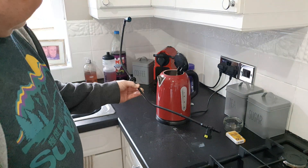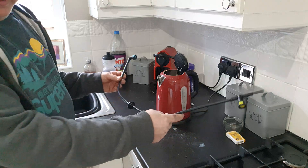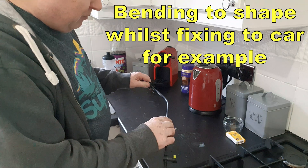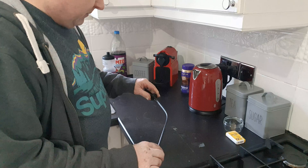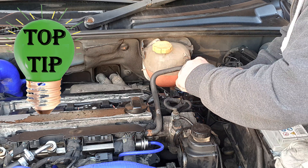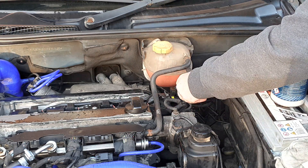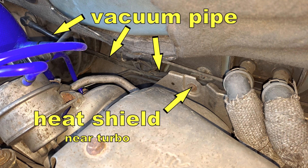I'm not actually going to attempt to replicate the pipe I'm replacing exactly — putting these two pipes in means I can give it a slightly different route around the engine. You could use a heat gun to do that, particularly if you've got a complex shape, but be very very careful — don't get the pipe too hot. If you melt the pipe you'll ruin it completely; just get it warm enough to give it a little bit of shape. When you come to assemble your new pipe onto your car, lubricate the O-rings with a Q-tip and some silicone grease — never put O-rings on dry. And if like on this Saab the original pipe goes behind a heat shield, make sure to put the new pipe behind the heat shield too, as that's there to protect the pipe from any heat source.